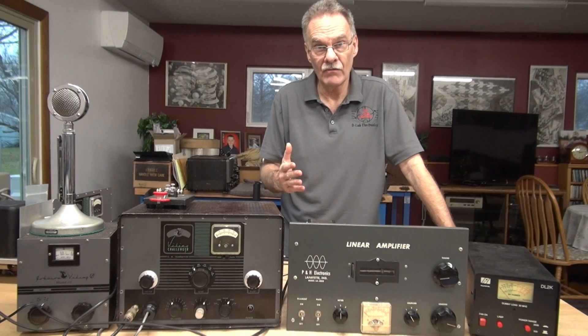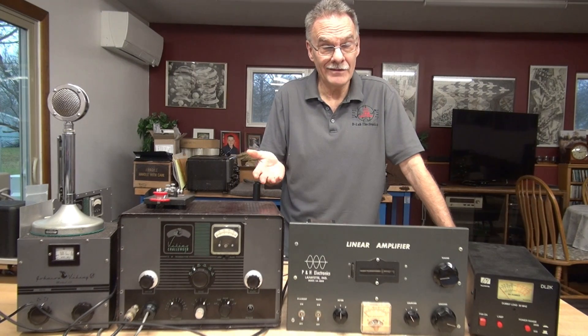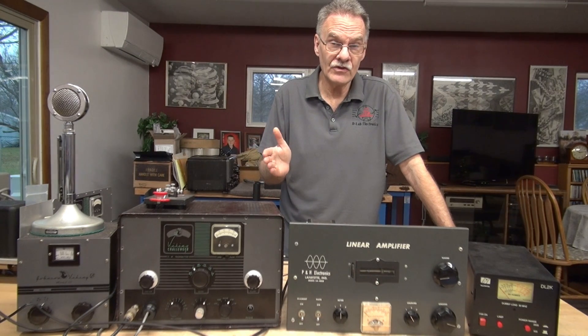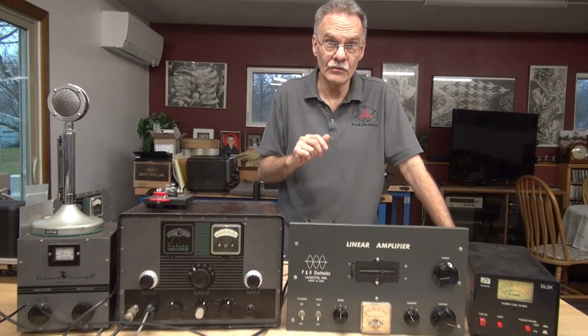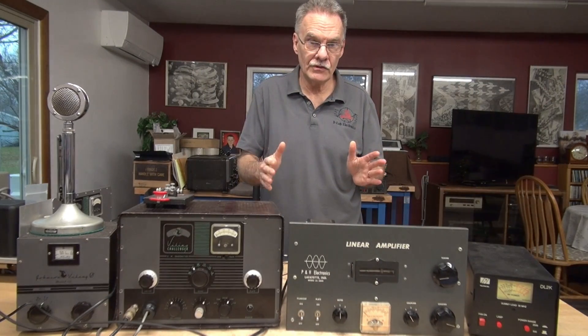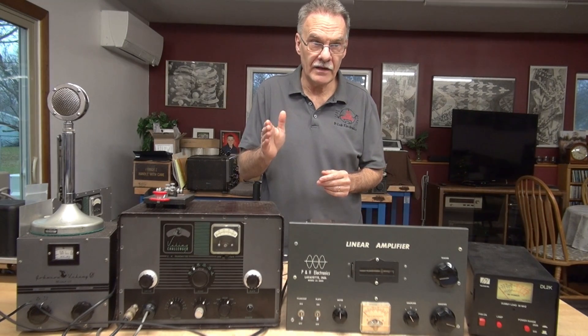To address the second comment — why did I leave the old legacy RF voltage monitoring circuits installed? Well, the meter had that function and I thought it would be okay to leave it intact. But I agree it did not appear on any grounded grid design, and it could affect the signal quality going to the cathode. So it's been removed. I've made the changes to the amplifier and updated the schematic, which I will post in this video.